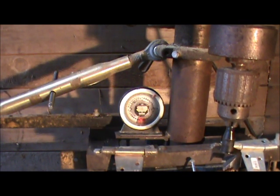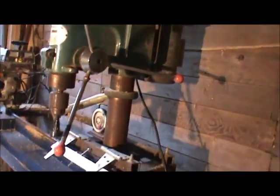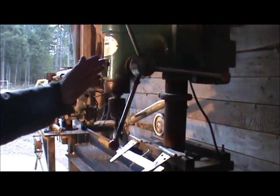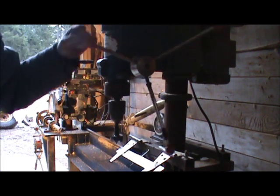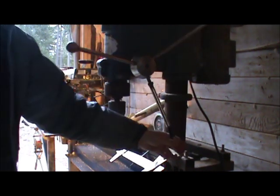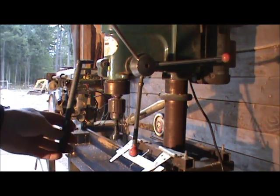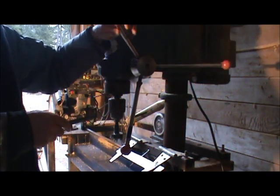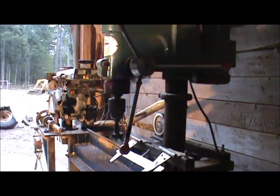When you've tipped the drill press down too far, these handles will end up hitting the log. So I've made myself some short little ones to deal with that — I just unscrew these ones out like so and place the short ones in there like that.